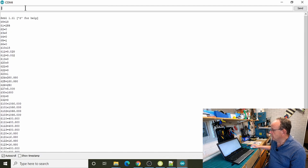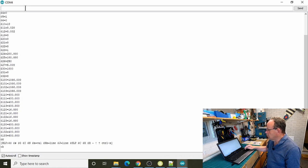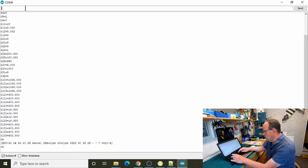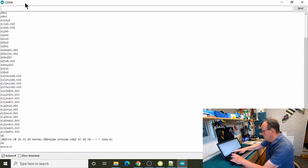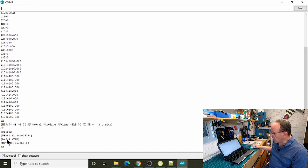And I think there's also, we'll just do a dollar for help. And then I think if we do $i. Yeah, there we are, on $i there. You can see it's got the axis X, Y, Z and U. So that confirms you've got the correct firmware on there. If that said X, Y, Z and A, it means you haven't got the configuration changes. That's what took me a little while to get sorted. So that firmware is now okay, and we should be able to connect to it.